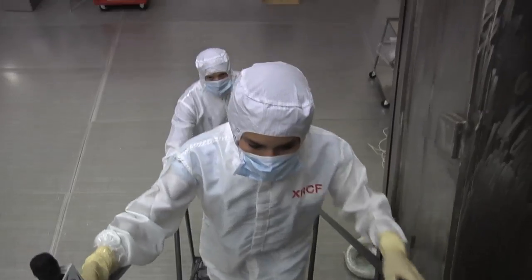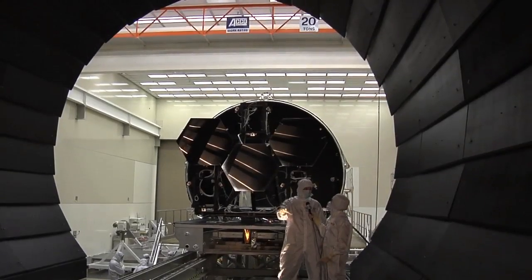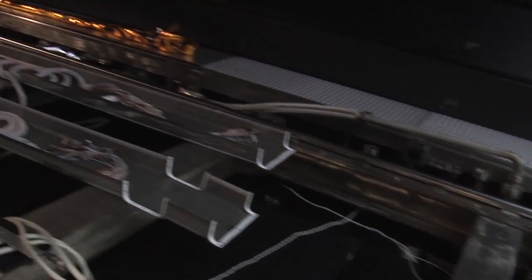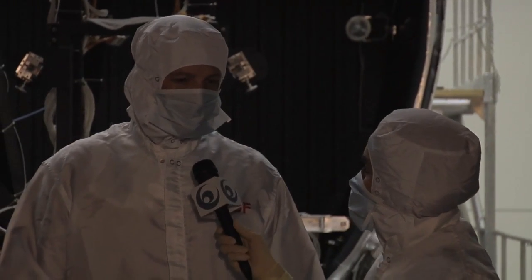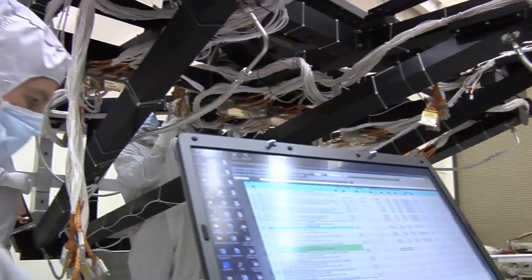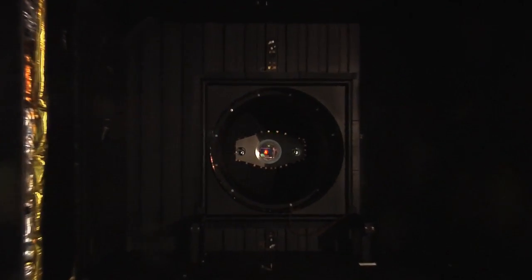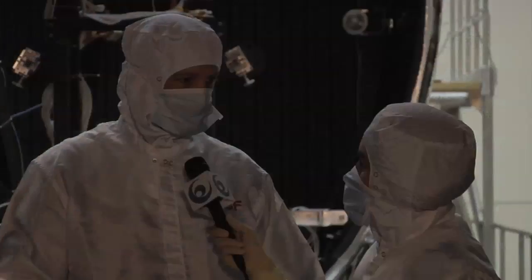Can we go inside the chamber just to see what it's like? The mirrors behind us will be pulled in and will actually reside just up in front of us here inside the chamber, where they can be cooled to minus 400 degrees. Why a vacuum chamber? Well, we have to simulate not only the thermal environment, but also the vacuum environment of space. The Ball Aerospace team is responsible for the testing, and they will be looking at these mirrors as they transition to cryogenic temperature through a window in the front of our vacuum chamber. They'll be looking at these mirrors with an instrument called an interferometer, which gives them a very detailed surface map of what that mirror looks like and how it deforms as a function of temperature.